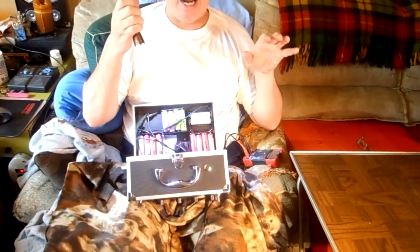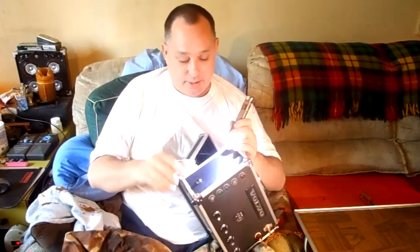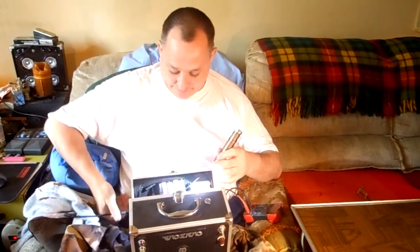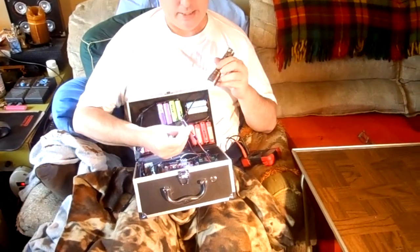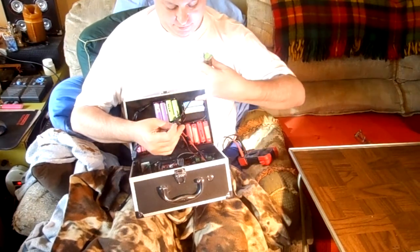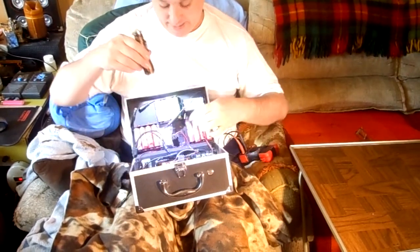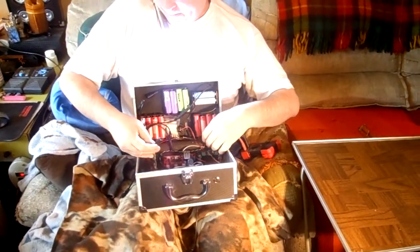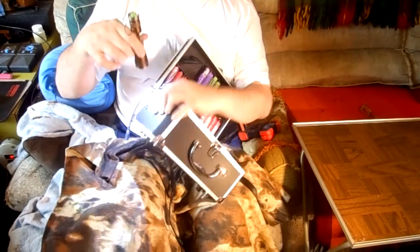Keeping the LED circuit on its own circuit is going to solve some problems — it may have caused some noise — and those LEDs dancing could drain my power, so I just put them on their own circuit. How it works: there is a side jack where you can plug a wall wart adapter into, and that comes out to here. The whole main powering bus — this jack here — goes into a switch and then the fuse, and this turns on both the main battery circuit and that LED battery circuit. If you want to run off a power supply, you can take these batteries out and merely plug this jack into here, and then you're connected to plug the main powering bus jack in, which terminates here.